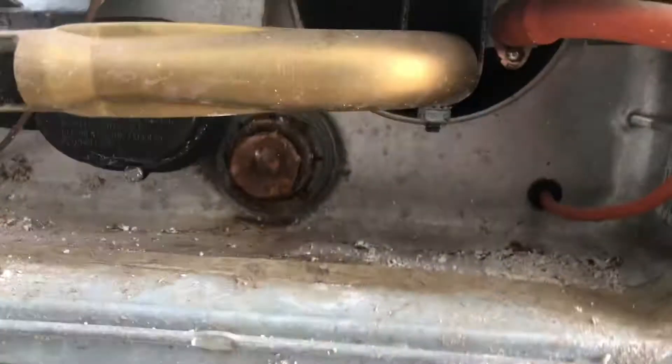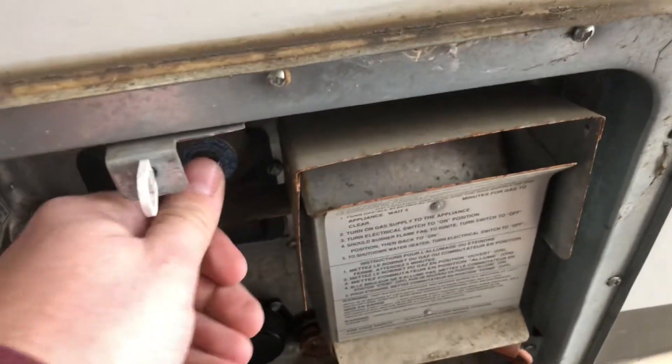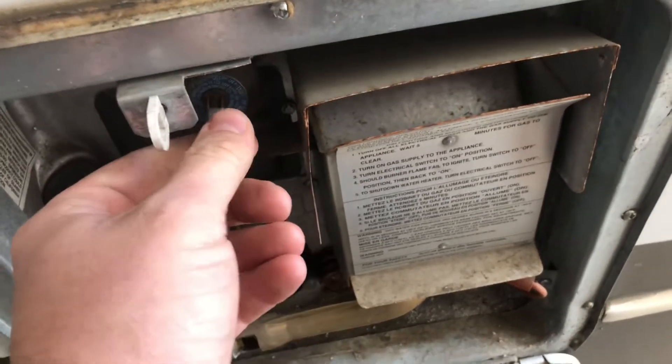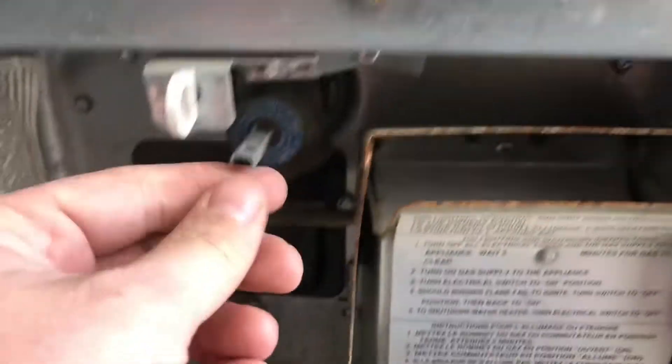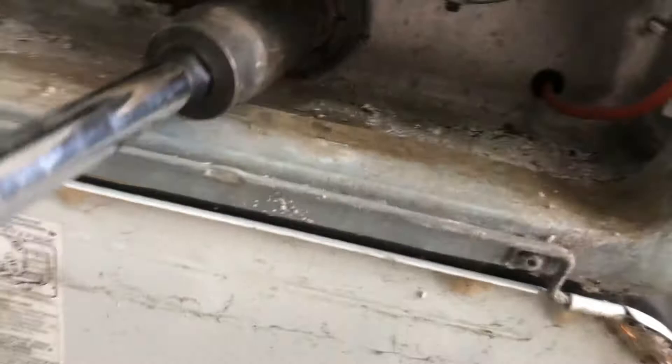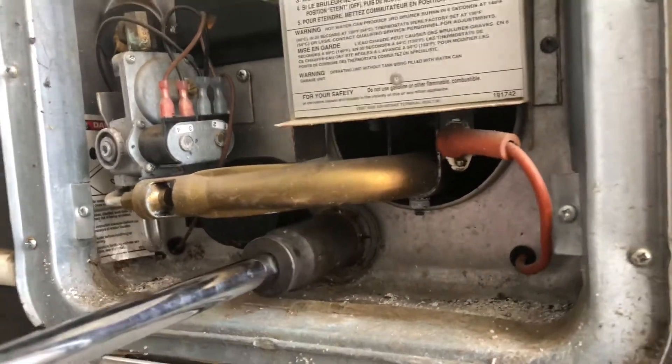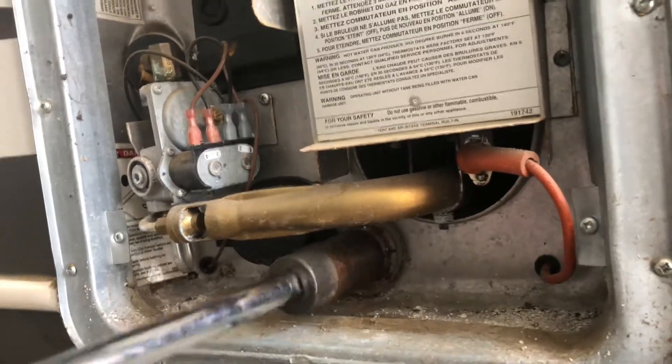Even after it's off, touch it to make sure it's not warm — it should be nice and cold. There's the plug right in the bottom there. First thing I do, after making sure it's off and there's no hot water in it, is relieve some of the pressure by opening the TPR valve right there, then reclose it. Come down here and put your socket in. This water heater is pretty dirty — it needs to be serviced; maybe that can be our next video.